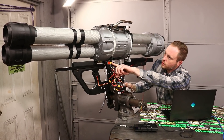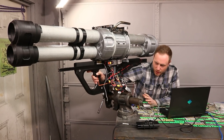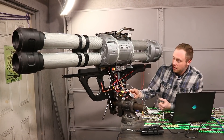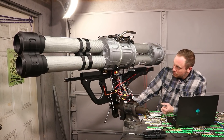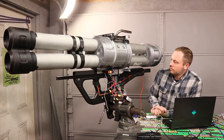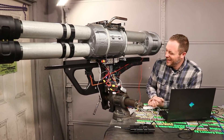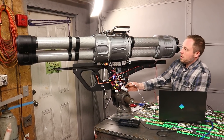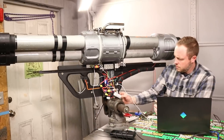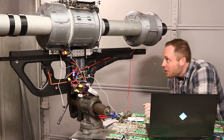Back to ultra slow — here we go to actually move the cylinder. It spins! We went to 50 RPM and 500 acceleration, then 70 RPM. That was pretty cool but the acceleration was terrible. At 1200 acceleration it was quicker, and at 2000 we may have found max acceleration. Something may have moved a little and got caught on the frame. We did a little more tuning, found a small bug in the code, and are getting it dialed in. At 3000 acceleration and 30 RPM she's starting to sound pretty good. We tried bumping to 50 RPM but that seemed over our max speed.